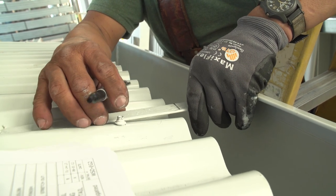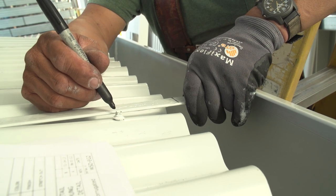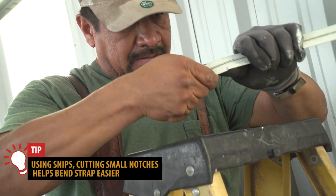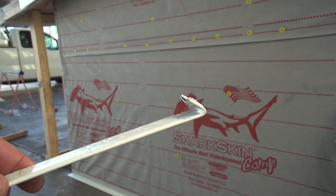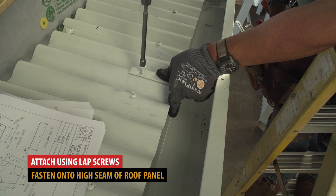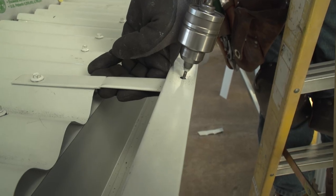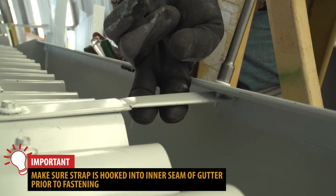Place your strap in its position and mark the edge of your roof line. Place an additional mark on where the screw will be placed. Next, bend the strap at the marked line to the angle of your roof. Then pre-drill the gutter and strap. Prior to drilling, hook the strap onto the gutter open hem. Attach the strap using a lap screw to the high seam of your roofing panel. Pre-drill the gutter and strap, then attach the lower section of the strap to the gutter using a lap screw.